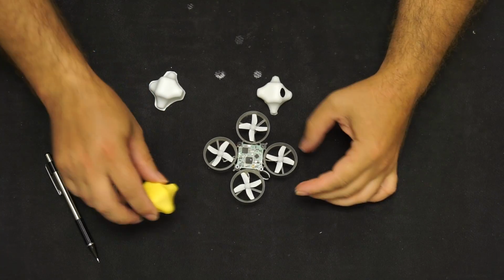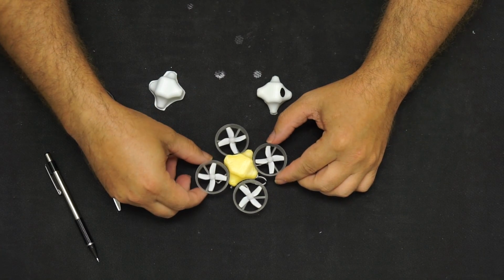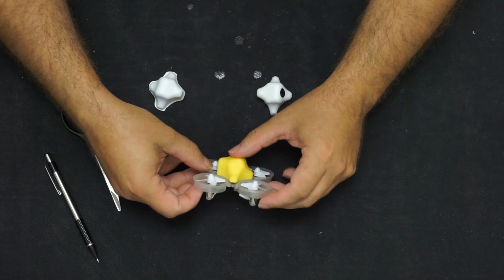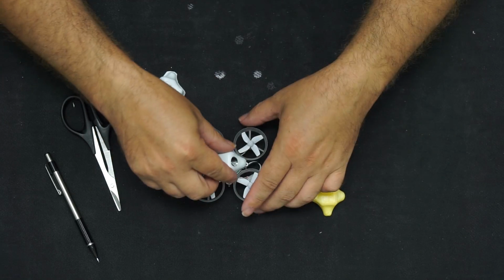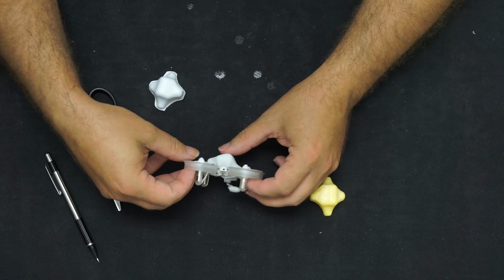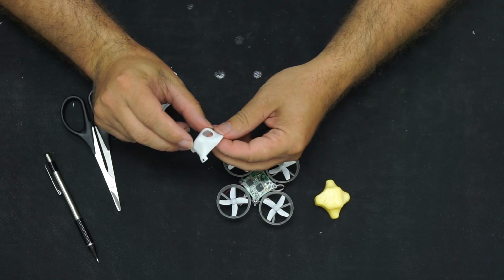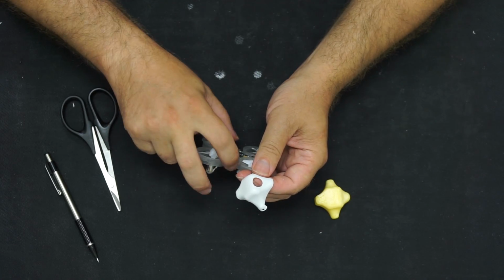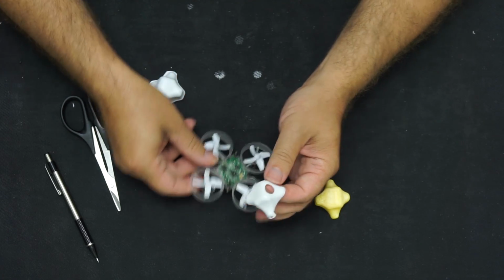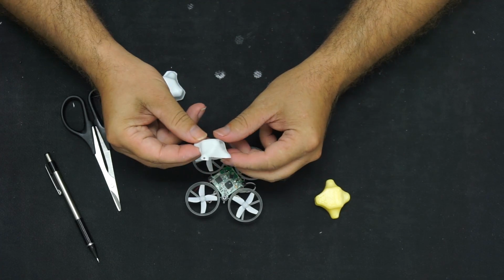Okay, so I have our 3D printed mold that we just used to vacuum form, and you can see how it just sits up on top of that. But you can clearly see it's much taller than the original little hood that we designed for it, because it was designed to sit down below. If we take a look at these little legs, you can see how the tab comes down, and that's just to mimic the original one that catches onto these little body posts right in here. You can also see how it comes up along the back and cuts down at the front lip.